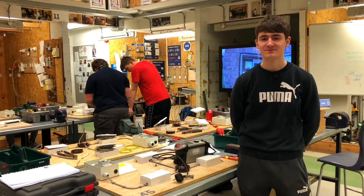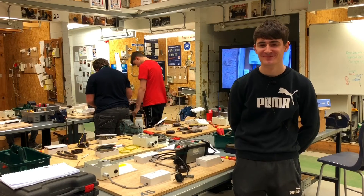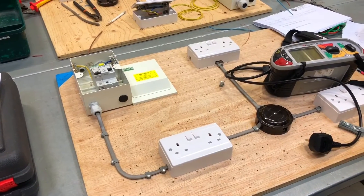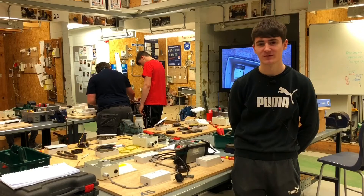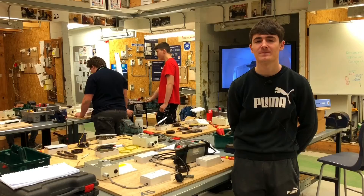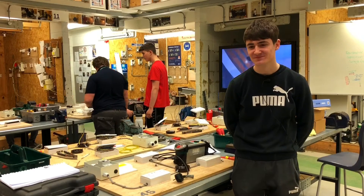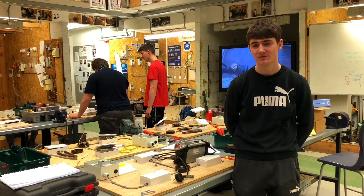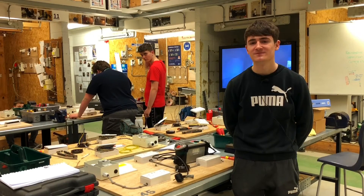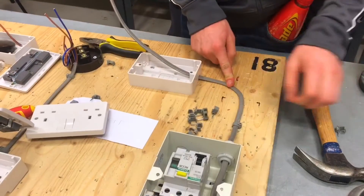I've spun over to Ben — Ben's already told me he doesn't need my face on camera because his is the money. Let's see if you're the money when it comes to the questions. What type of circuit have you wired? A3 radial. Maximum floor area it can serve? 50 metres squared. What size is the breaker in the consumer unit? 20 amps. Does the circuit require RCD protection? Yes. The rated value of the RCD? 30 milliamps or lower. What type of protection does the RCD offer? Additional. And what type of faults will the RCD clear? Earth fault current.